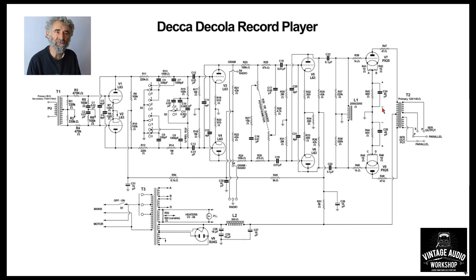With such a complex amplifier you might expect a thumping great output. Notice there is no negative feedback in the output stage — nothing coming back from there. It drives three parallel 12-inch speakers and is very, very loud. So what is the output? Well, you might be surprised to hear it is a mere 6 watts.